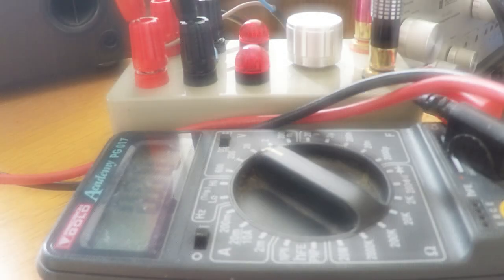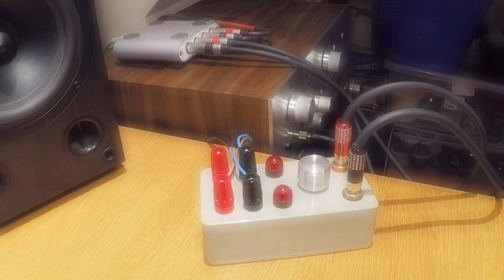As you can see, it has built-in level indicators, two independent channels, and no external power source other than the amplified input drive signal. It also has a highly natural and unobtrusive compression characteristic due to its inherent true RMS level detection, smooth knee, and attack release time constants. If you've ever wanted an analog compressor with these sorts of features, then you'd be looking at a cost of well over £200, if not more.